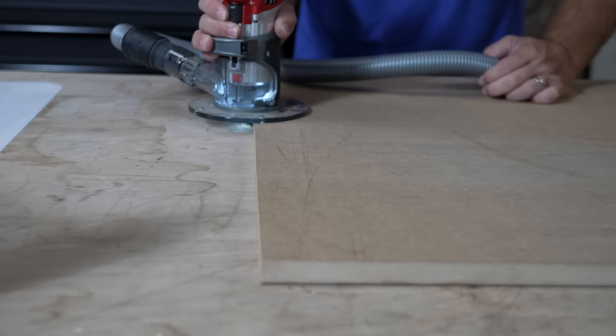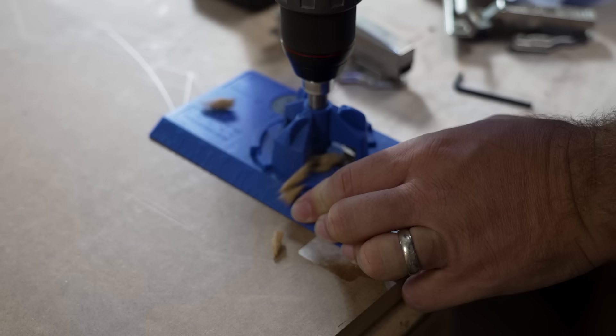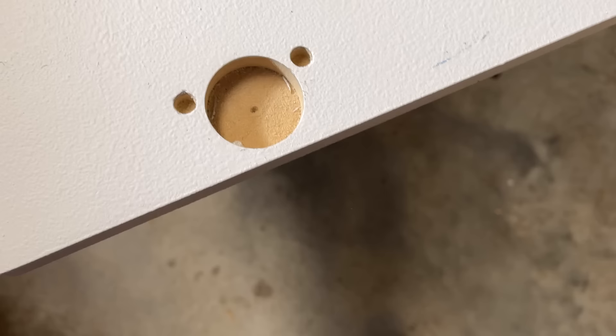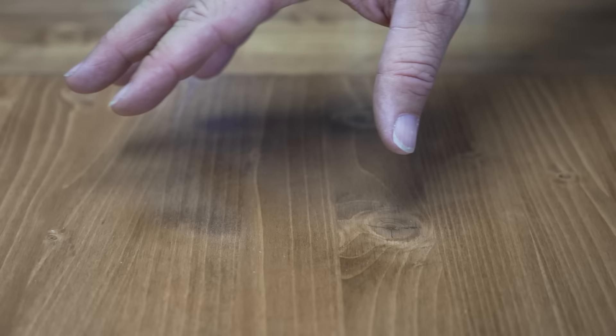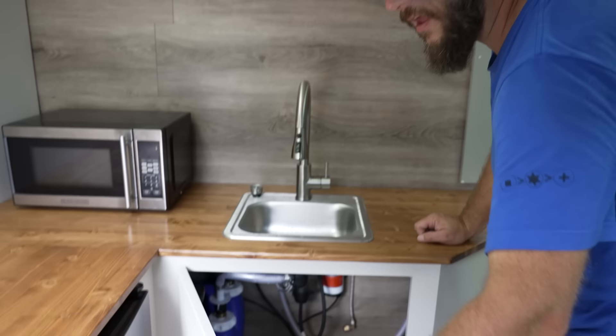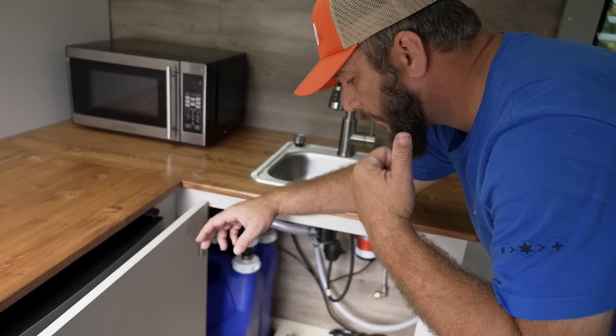Today I just cut the door out of a piece of MDF and used my router to put a round-over on the edge. Then I drilled out for the cabinet hinges using my handy dandy Kreg hinge boring kit, and put in these Blum press-in hinges. For the countertop, I just went to the local hardware store — I think I got this at Lowe's. I could have glued up some 4x4s for the countertop, but to save time and because these were cheaper, I just bought these glued panels. I've got videos on all this — I'll put links in the description.